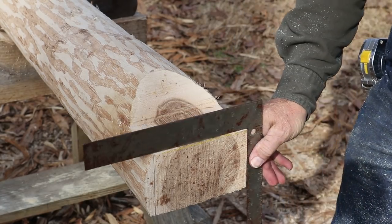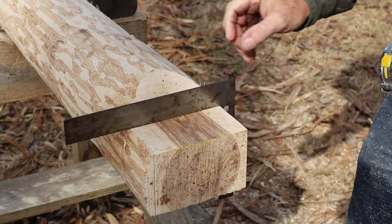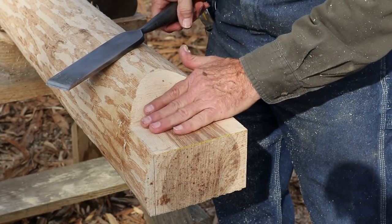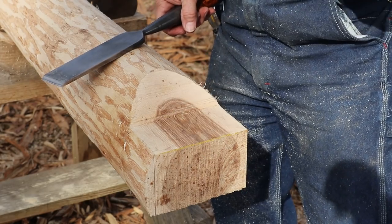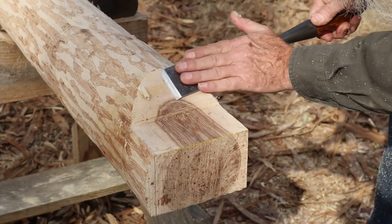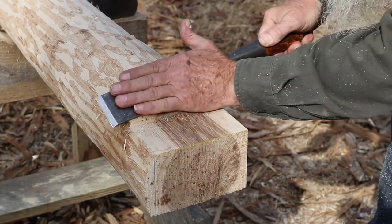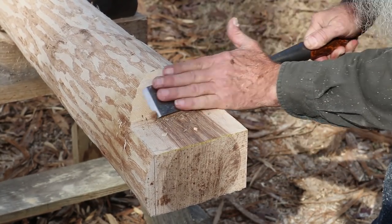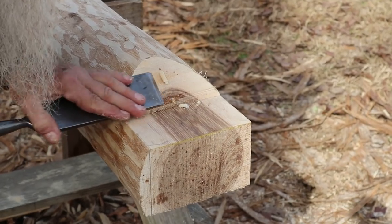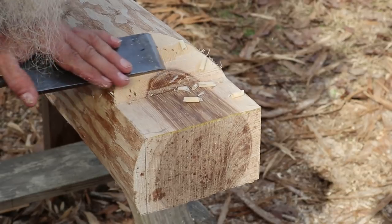I've got that all the way across — it's nice and flat. This side is square off the very top. Now, this is not something you necessarily do for a floor joist since it's going to be underneath the house and not even seen, but it's good practice to get into at this point of your build to really get things as clean as you possibly can. All I'm doing is cleaning up the marks the chainsaw left from the chain.